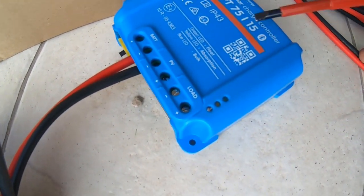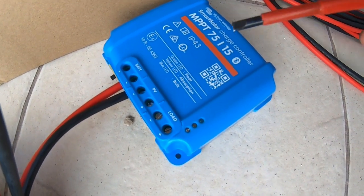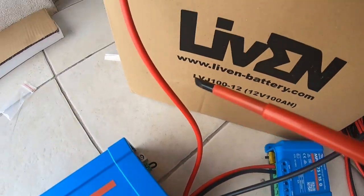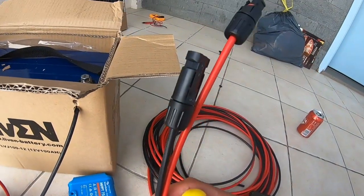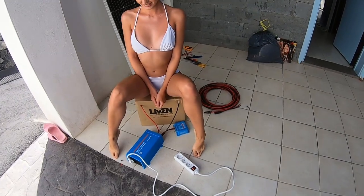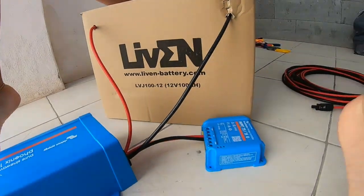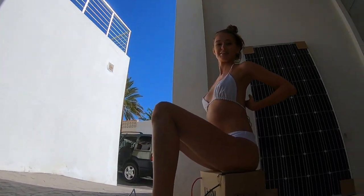Bulk is the stage of charging when the charge controller is doing the maximum it can — and the maximum it can do is 15 amps. It's important to put the red cable to the correct terminal. Here we have a complete system: the battery in its original box. You can turn on the inverter — inverter is on, so we have 220 volts. I think the system looks beautiful.